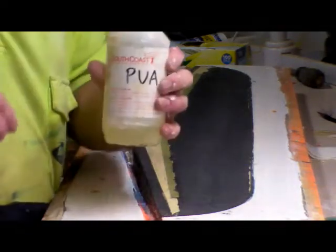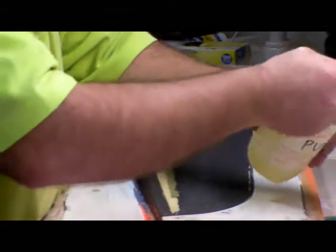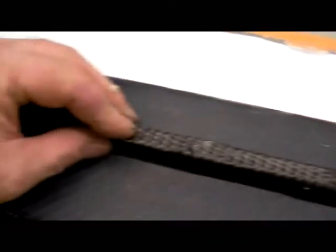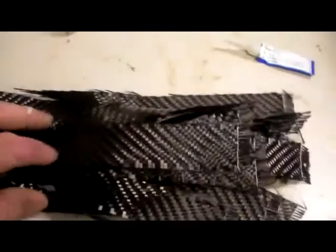Now that I've trimmed everything up to the mould, I'm going to put some PVA mould release, just run on this edge here. I know my moulds are quite seasoned now so I don't really need to do this, but I'd rather do this than have my moulds stick together. I've got everything ready to go. I've taken my spars and I've CA'd them into place — they're quite firm so they're not going to move around when I'm putting the wing together. I've brought them on there dry so I'm going to wet them up in the mould. I've got all my triangles of leftover carbon from cutting the wing skins out, all ready to go. I've got my carbon tows on here — the long ones are going to go into the leading edge. There are 20 carbon tows there, 200 gram. And I've got carbon tows here that are going to go on the ailerons — they'll make them nice and stiff.